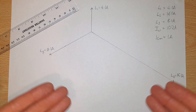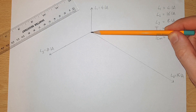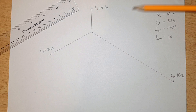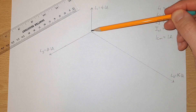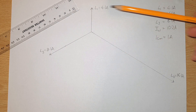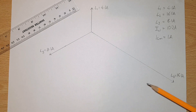In order to graphically represent what's happening when these currents all meet each other we can use an analogy: imagine an object having three forces acting on it — one pulling in this direction, one in this direction, and one in this direction. The biggest pull is one way but the other forces are also dragging or opposing it, so they balance out and the object ends up going off in some resultant direction. We're not talking about forces but about currents, and the same principles apply. What we've got to do is draw parallel lines to all of these arrows.